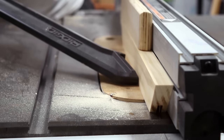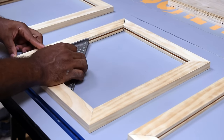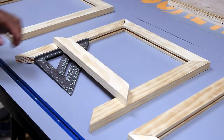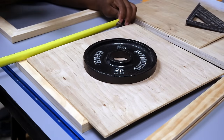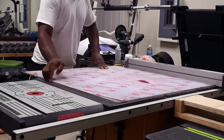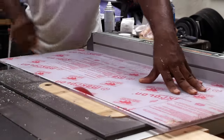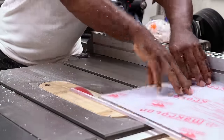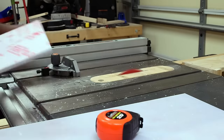Since the glass panel is thicker than the blade, I need to make multiple passes while moving the table saw fence to create a bigger track. Before cutting the glass panel I need to figure out the exact size, so I squared up the frame and took exact measurements. For this project I'm using plexiglass; the next version I'll be using real glass which I will get pre-cut. When cutting plexiglass, the key to getting a clean cut is to use a blade with a minimum of 60 teeth.